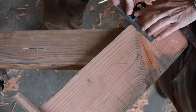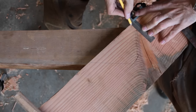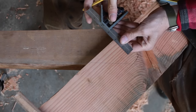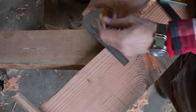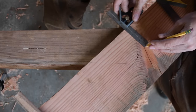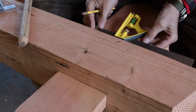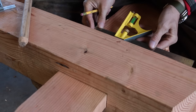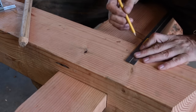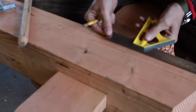To visualize it, we'll draw it out. We know that it goes in 90, then comes into 45, and it's three inches — that was the length of our tenon from the shoulder. So if we draw it out, what's exactly inside the wood is this right here. This one is different, we've got a lot more material — we've got six and a half, so we'll go three and a quarter. If we mark here on the edge and then come down three and a quarter.